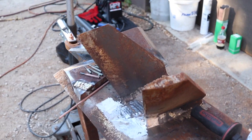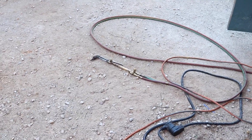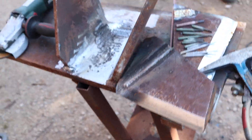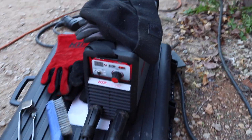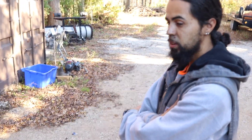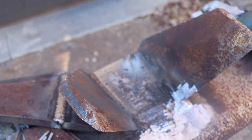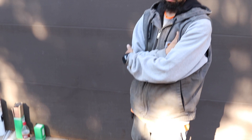On the Brutus you get golden shiny welds, a little bit like stainless, with really good high-strength welds in the 100,000 to 130,000 PSI tensile range — though if you're not careful you can get a little inclusion. The Polaris is your 7018 on steroids. This is AR400 material — an 8-way wedge out of a commercial log splitter. We do preheat with the oxyacetylene torch to just shy of 400 degrees on five-eighths or three-quarter material, then stick weld it all up with this new HTP InverArc 160 Plus. Did you hit duty cycle today? No I did not.